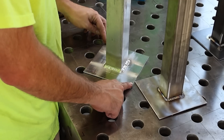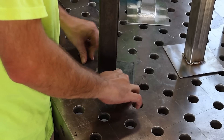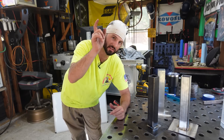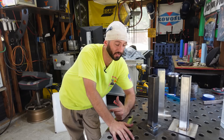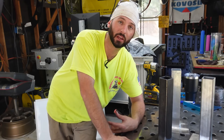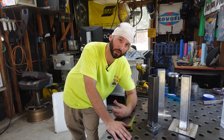So how do you prevent that? Clamping all four sides and fixing things in place so they cannot move when you go to weld them. Same thing with aluminum — we have a bit of a wobble in that plate. Carbon steel had probably the least amount of wobble. What exactly is it in these different materials that makes things pull so differently? Let us know down in the comments — I'd like to hear your opinions. If you have suggestions for cool things to try out, let us know. That's the beauty of the industry: you'll never quit learning. We'll see you on the next learning experiment.